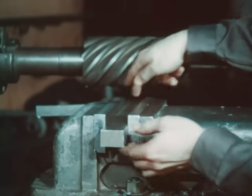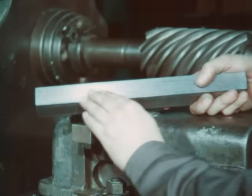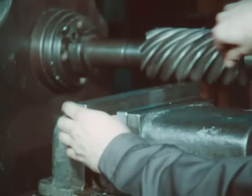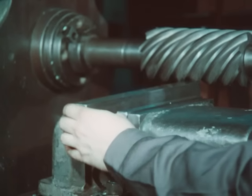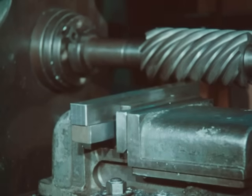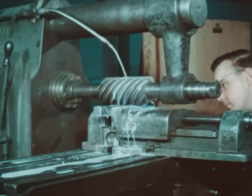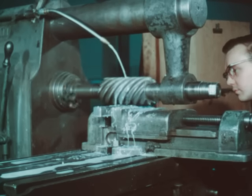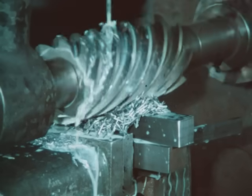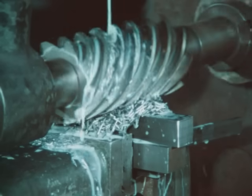Place the master key in the vise on the milling machine. The new key is now placed on the master key with the previously milled side down and clamped tight. Starting at the large end, mill completely across the new key. The key will now assume the same shape as the master key, or a taper of one-eighth inch per foot. The key should be cut about ten thousandths oversize to allow for an interference fit.